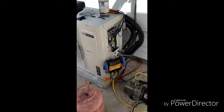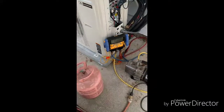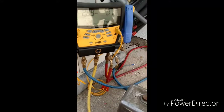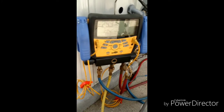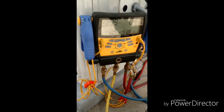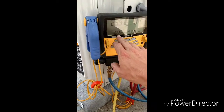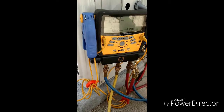After you do that, turn off your gauge on the low side, leave your pump on and let it run for about five minutes, then turn your pump off. The system went up to about 700 microns at that point, but it held at 700 microns for about 30 minutes.